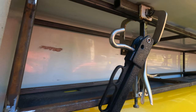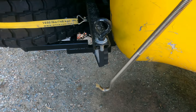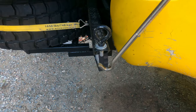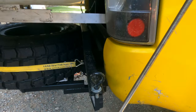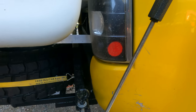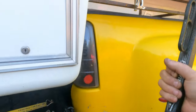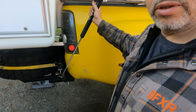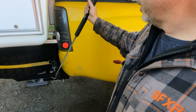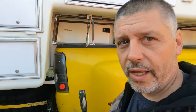What I'm going to do is add a tubing inside of this tubing to bring out my base a bit — similar to a regular camper tie-down where they slide in and out when needed. That'll bring it more straight down with less angle, and cure the problem. When the box is done I'll put the extra tube in, come out as far as I need to, and lock that in with a pin.